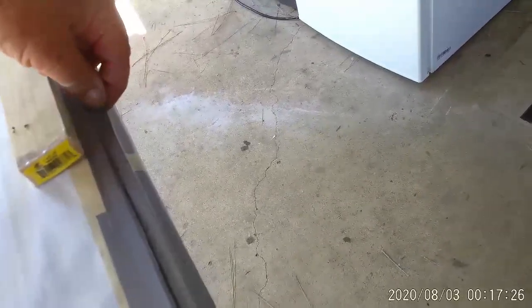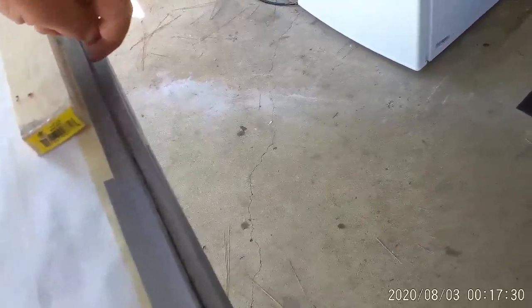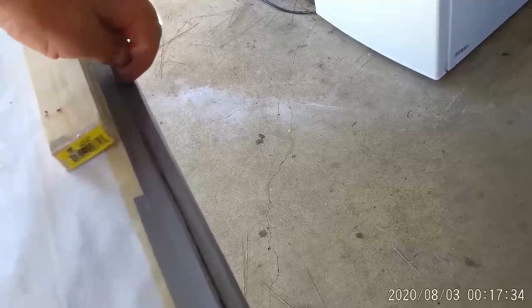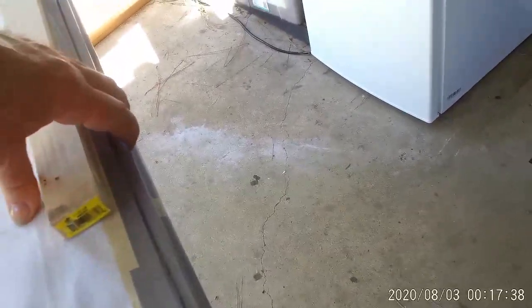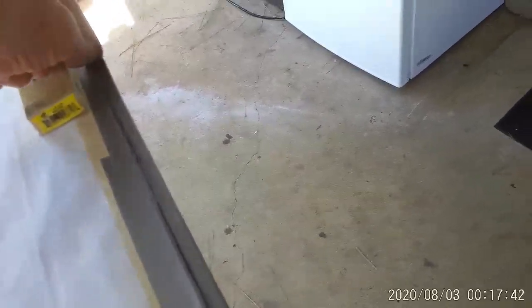We'll come in with a little squared-off tongue depressor to scrape off the excess glue that's going to squeeze out of this joint. I have tape on the spar flange here so that the epoxy does not stick to that flange, because I'm going to have to bond the wing skins and the rib cap strips to this flange later. We don't want a bunch of glue on it, so all of this is taped off so glue doesn't go where we don't want it.